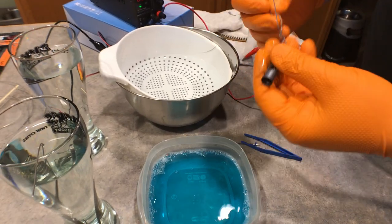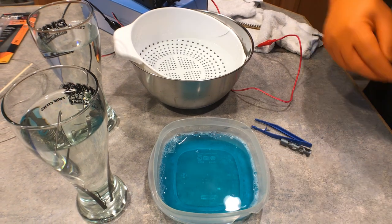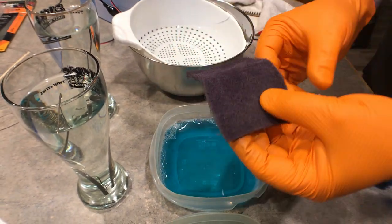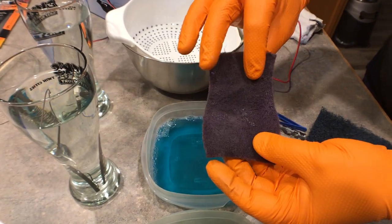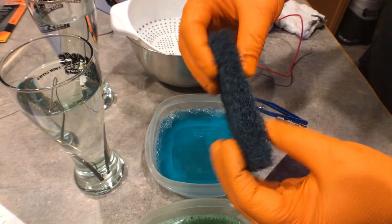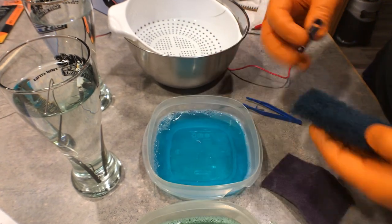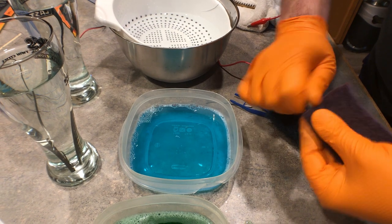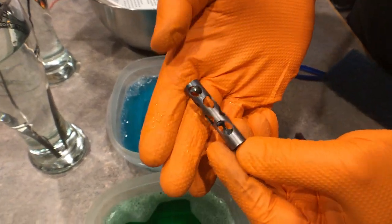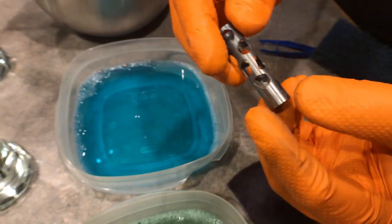Anyway guys, just showing some different things you can do. When I talk about scotch bright I use things like this - this is the purple 3M scotch bright. The different colors are kind of like different grits, similar to sandpaper. And here's the teal or green-blue color which is a really open sponge but pretty coarse and aggressive. You can see on this part - if I take this scotch bright to it now that I've anodized it - you can tell the anodizing is gone on the bottom and it's still there on the top.